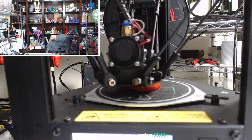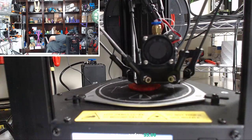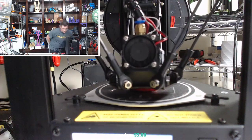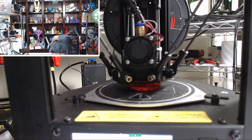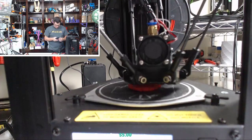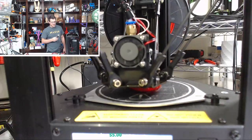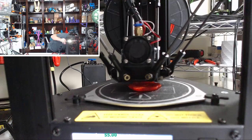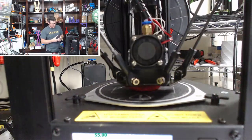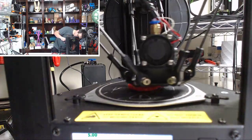So they're using dual 6mm rods, it looks like, with the short bearings. Injection molded carriage. Very simple. Wait, is that an IR? I need a flashlight. Well, I have a flashlight on my phone, Shane. Oh yeah, these are IR end stops. They're not buttons. That's interesting. So they're infrared end stops. They are still using plastic bearings on the idlers. They are toothed though, so it is getting a nice grip on that. They seem to be lubed pretty well.